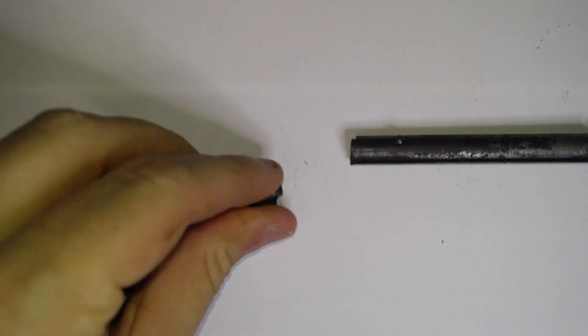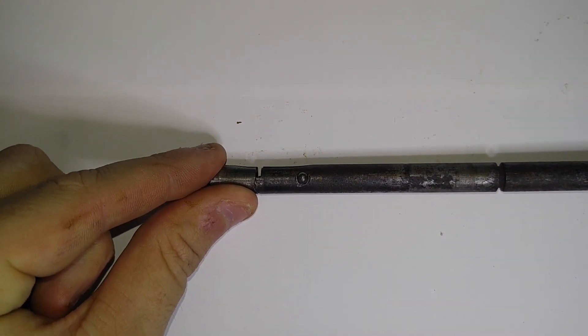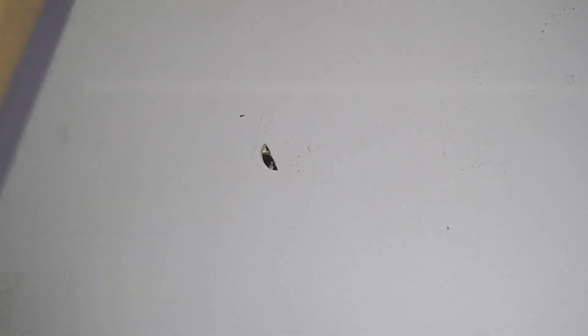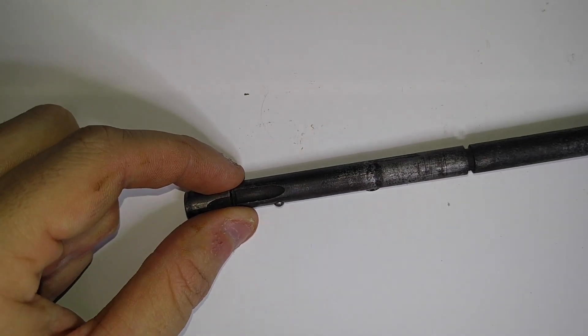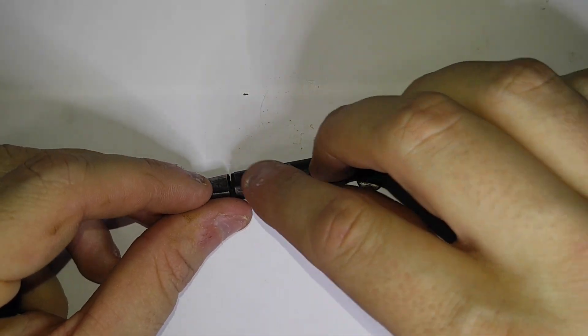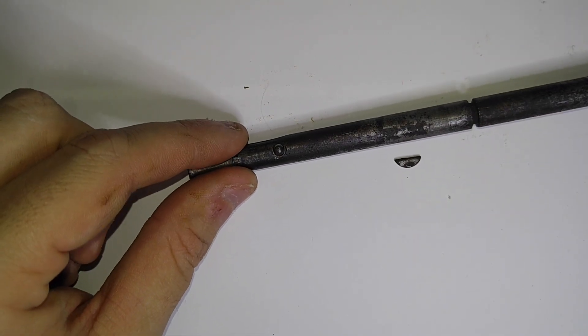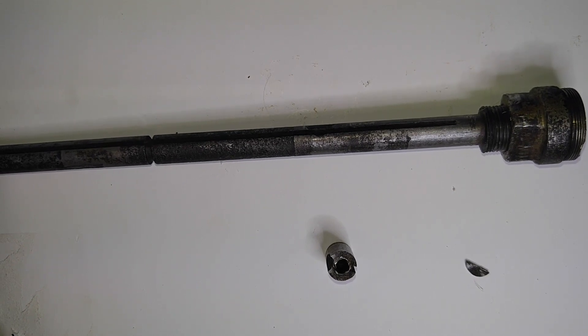You'll know how it goes together when you see it because it's sheared off in a way that's visible. There's a little notch right there, and inside that notch goes this tiny little semicircle piece of metal. That piece is not broken itself — it's just used like a pin. When this is together and installed, that little semicircle slides into this slot and holds this rod in place at some part of the drill.